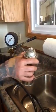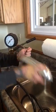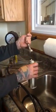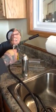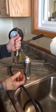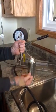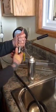These cans have been filled up with water and they have a top crimped on already, so it's not going to take much water to fill. The reason we fill it with water is we don't want any kind of compression like a gas — an explosion. This is done with water so it's a solid. When a solid expands, it just goes blip — there's no explosion, no compression.